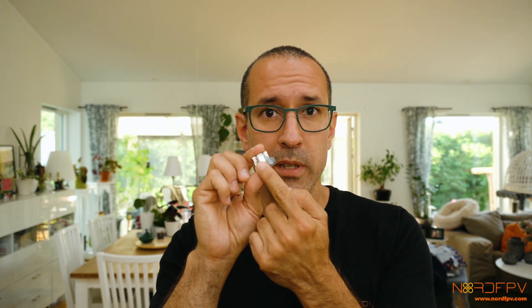The smart part is that this little device is not just the battery — it has a beeper. So you are installing a beeper on your drone, which is always good when you are flying long range, and even if you're not flying long range it's always good to have a good beeper. It's a self-standing beeper because it has this battery, and that same battery helps the GPS.